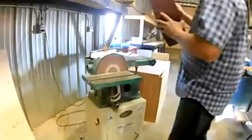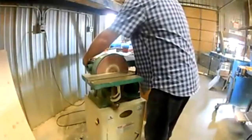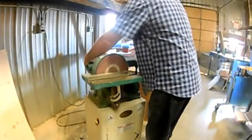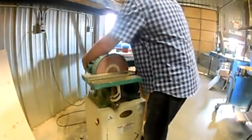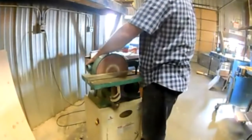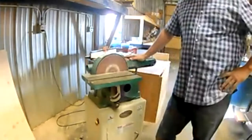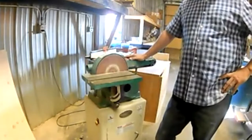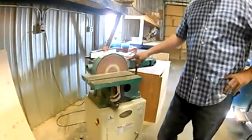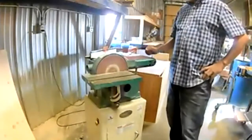You can see direction arrows in there — those have to go in the direction of the machine's rotation, otherwise you'll have a failure. This belt is spliced together with a high-heat glue joint. When you get that glue joint too hot, beyond the capabilities of that glue, the splice joint right here will come apart, or you'll gouge it and start to tear off strips.